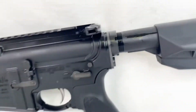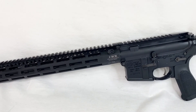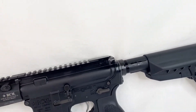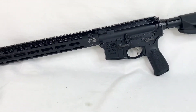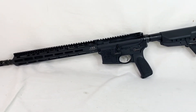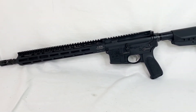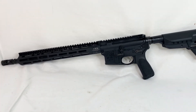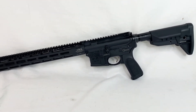Even that end plate there with the QD — all Gunfighter, BCM Gunfighter parts — and it's all in a black anodized finish. That's another great thing with BCM. Their finish is always a very deep, dark finish that's smooth and clear the whole way through. That really comes from the anodizing process, which is a tougher process, but overall just a very good-looking finish. That's why you'll usually see BCM blem models out there, because their inspection quality is of a higher standard. If something's just minusculely off, they don't put it in a production rifle — they sell it as a blem.